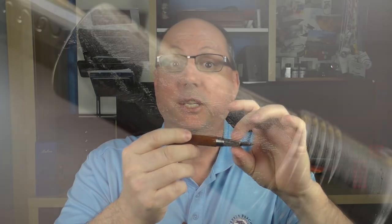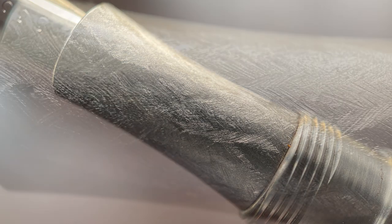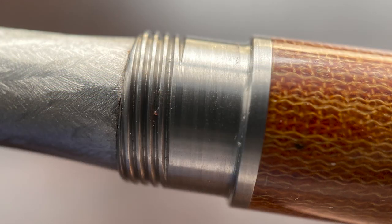This section is amazing. It's concave and machined from a solid bar of titanium, then hand-chased with a finishing tool used in the jewelry industry. The result is a very cool section. It looks fantastic, and this treatment also prevents the metal section from being slick at all. The grinding is shallow enough to facilitate a sufficient grip but not so prominent that you feel an overly distinct pattern like knurling. In the microscope shot it looks deeper than it really is — it almost feels more like a matte finish. There is a small step up from the section to the threads. Even though they're titanium they're not sharp at all, and then there's another small step up to the barrel.